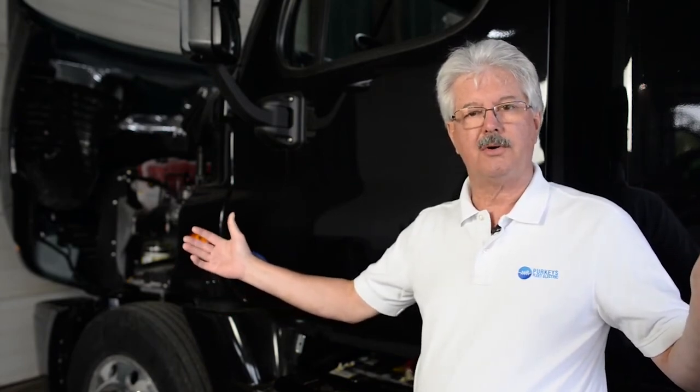Once you segregate and go across the battery pack as far as you can, that gets all the inner cell connectors. You're testing the complete battery pack as much as possible — that's what you want to do. You don't want to just put two leads on one battery because you're not testing all the other leads.